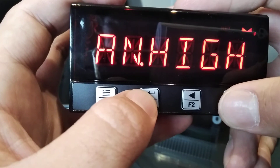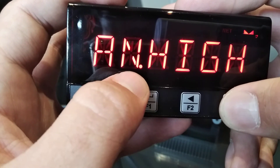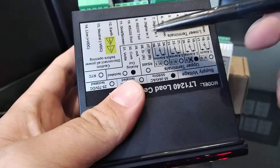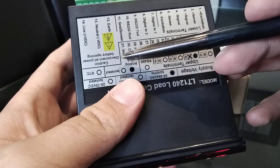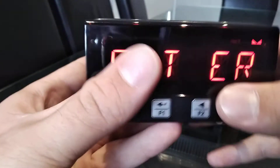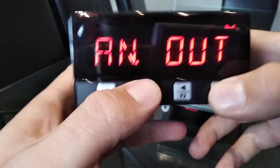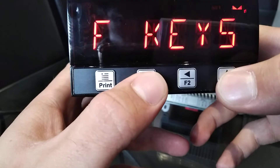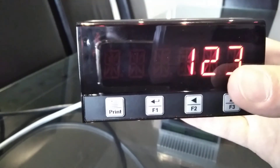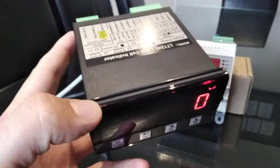Meaning at 4 milliamps the scale will read zero, and at 20 milliamps it would read 20,000. Once you've done that, you can connect it up to the milliamp or volt output and common. To exit this menu, hold Print until you get to AN Out, navigate to Exit, and press Enter. Here you will see your values change. That concludes the introduction for today.